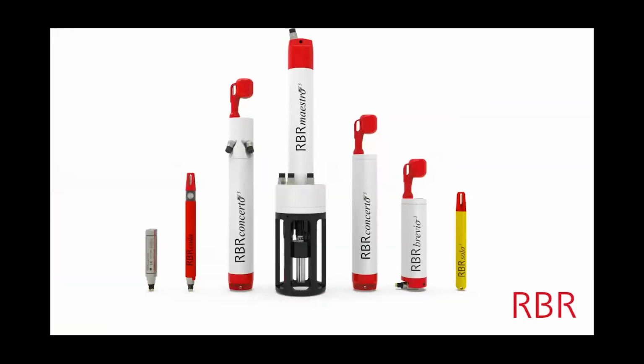In particular today, I just wanted to focus more on these sensors and loggers, which is really in my background. Here at this end, you see that we have two sensors. It's the dissolved oxygen sensor, and this is a temperature and depth sensor. You can see these actually have connectors on the end here. So you would power them, and it's the way to get the data off all in one, from one connector. These next four white loggers here are our standard instruments. They have batteries inside and memory inside, and these are all similar, but just slightly different.